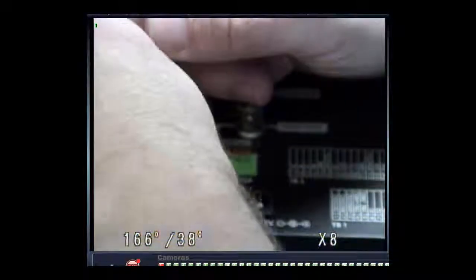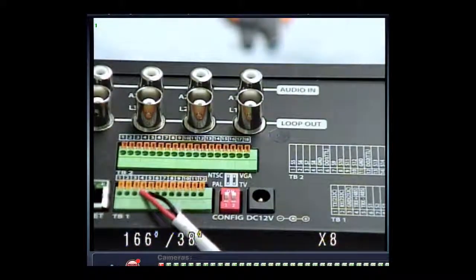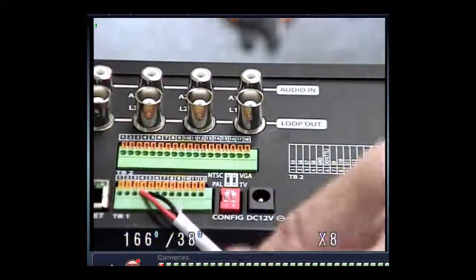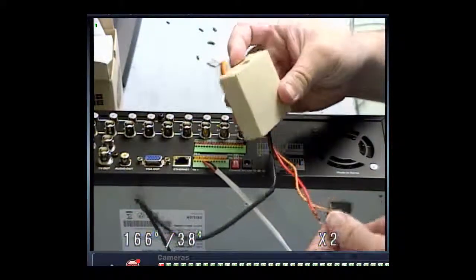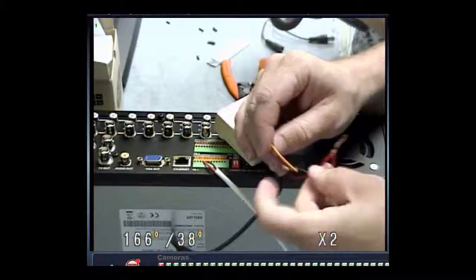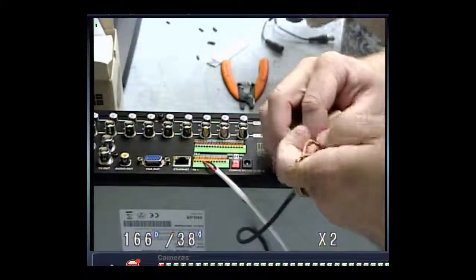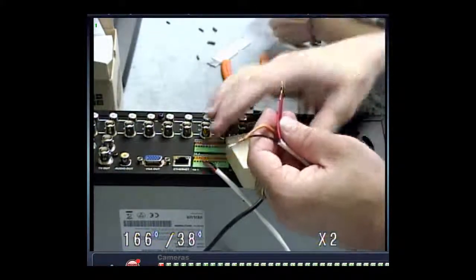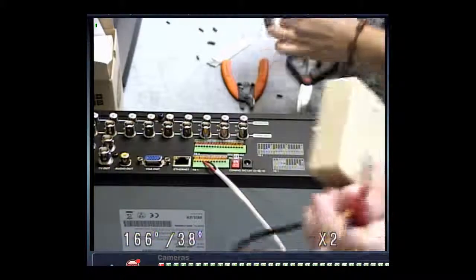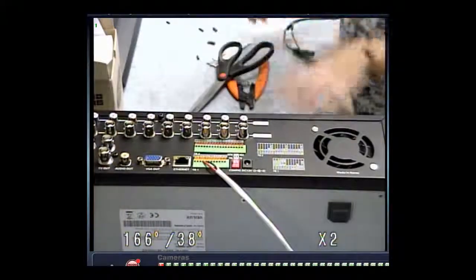Number 5 is negative, and I'm going to insert the black wire as negative. I want to be sure that the cables are in there very well. On the back of the port that the SVK-64 plugs into, you've got two wires coming out — sometimes it's green, sometimes it's black, sometimes it's orange. We're going to use orange, which is negative, and red which is always positive. We're going to plug the SVK-64 into this term block, and then go from settings from there.